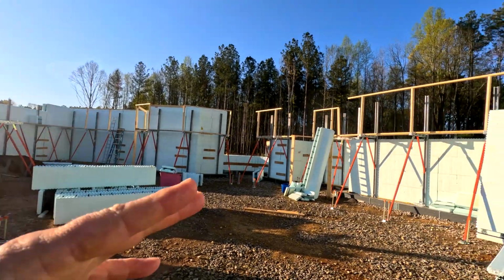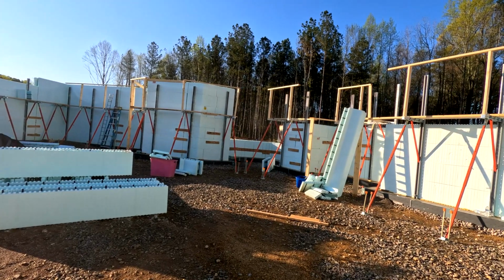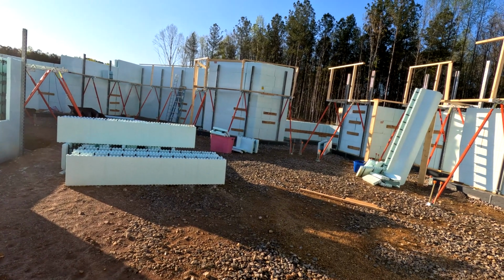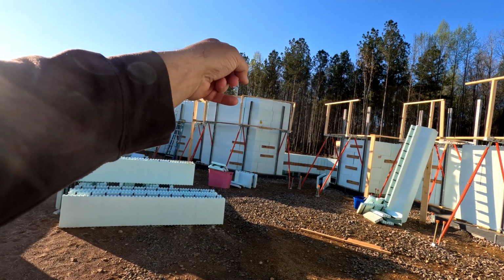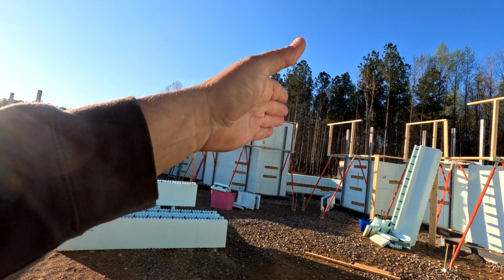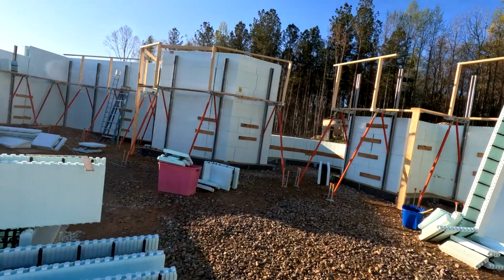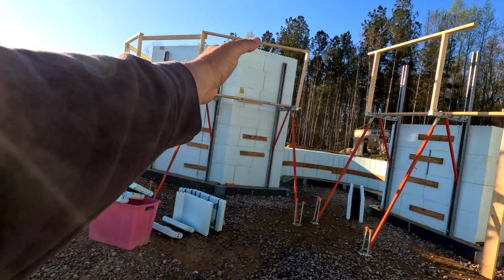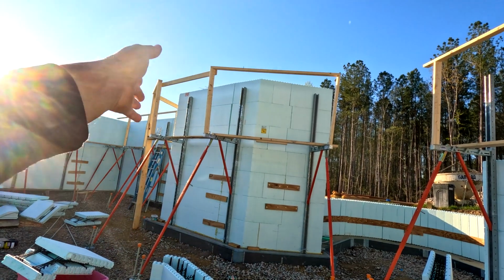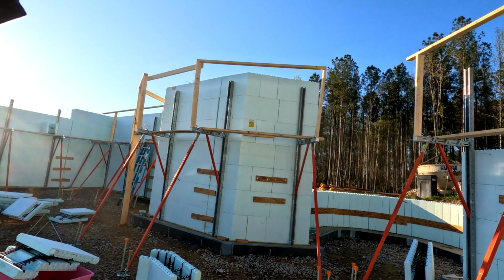So all the little finishing touches, dotting the I's, crossing the T's, are actually what's going to take probably the longest, because I have to come in here, figure out where the isolated footings go. Then we have to run a laser, and at the top of the wall, we have to cut out a pocket and form that in, and that's where, for example, roughly in here, there's columns that go across here, and then there's like a beam that runs back to that corner. So I have to get up there, cut that corner out to spec, either do a pre-buck with it or foam it in, etc. Get that secured so it's not going to move when we pour.